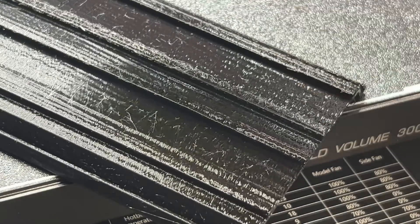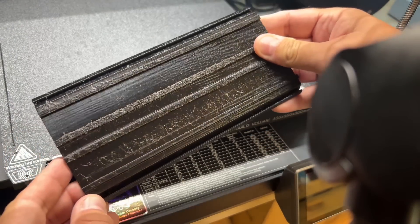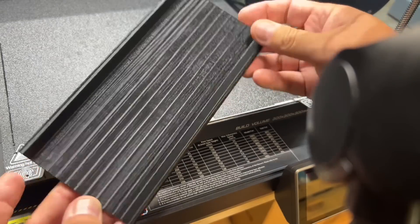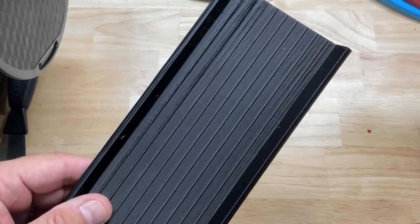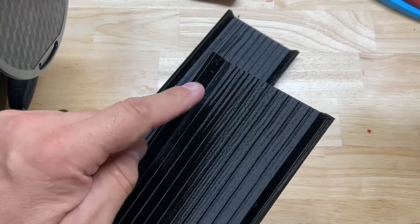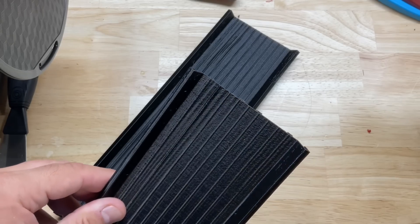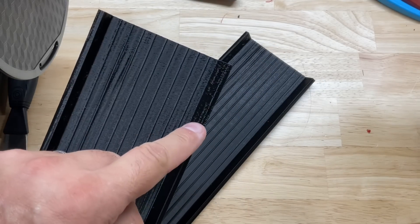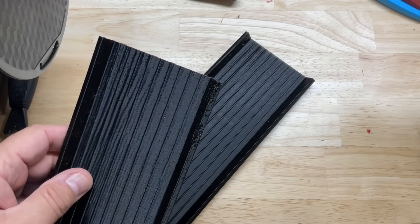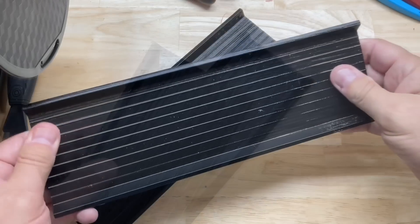There was a shorter piece that fell over and was really stringy — I need to hit that again with the heat gun — but the top surface looks really good. The longer sections looked really good until about 280 millimeters, where you could see a little wave like the thing was wiggling at the top. One piece was actually worse, with some roughness on the right side. So 290 millimeters may be too tall — I may have to go to 250 — but it did print without falling over.